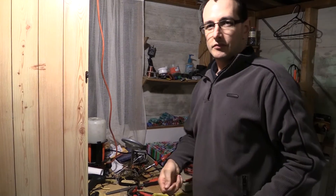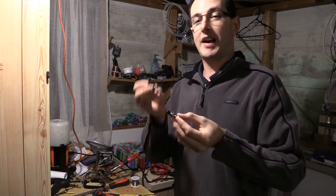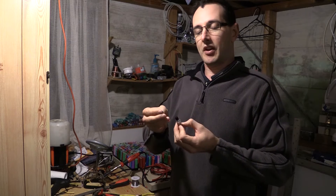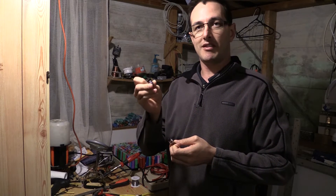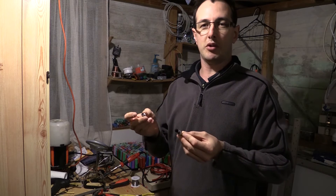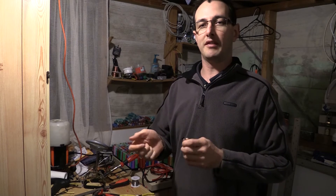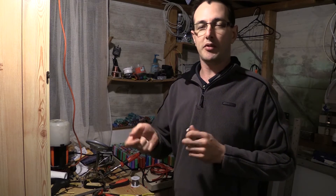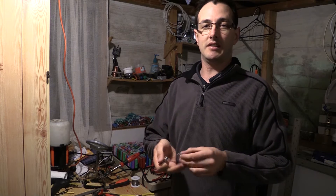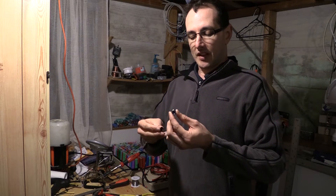What I've got is I've actually purchased a couple - a male and a female of the GX12 aviation plug. That way I can just use the female and plug the current CT sensor into this, and use the male end for the top of the inverter. Pretty much what I'm doing is just creating an extension cable. That way later down the track if I ever needed to test things or move the inverter, I've still got the original cable with the original plug to plug straight into the inverter again. It's just a two-prong extension with a male and a female end.